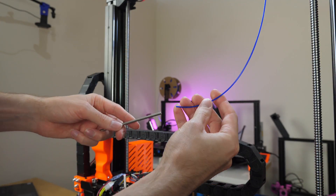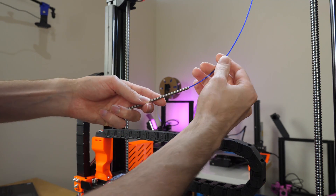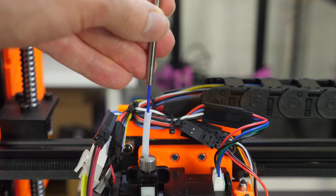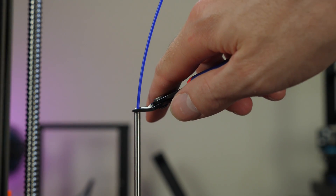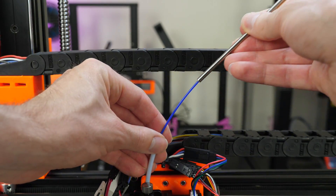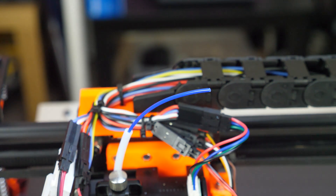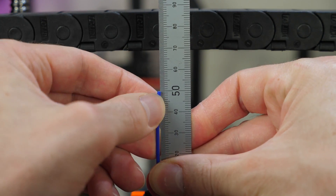To run this test I did the following: first I pushed the filament through a 150mm steel tube, then loaded the filament into the extruder and hotend and did a short manual purge. I then slid the tube down to the top of the extruder, cut the filament to the top of the tube and removed it. With the hotend heated I ran a custom gcode to extrude 100mm of filament, then used a ruler with 0.5mm increments to measure the remaining filament. Using a flow rate of 3mm³/s and medium idler tension at 220°C, I found it was over-extruding by about 5%, so I adjusted the steps per millimetre on the LCD screen and saved those to the EEPROM.